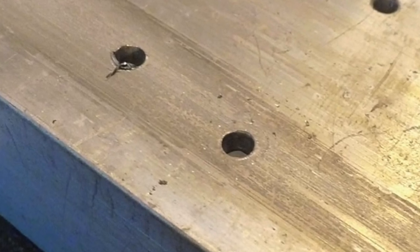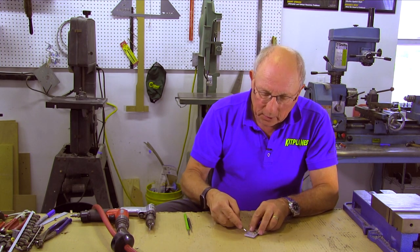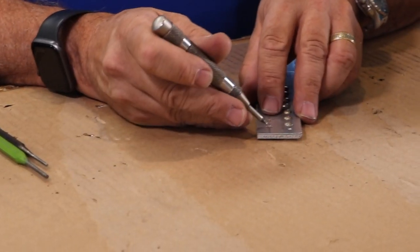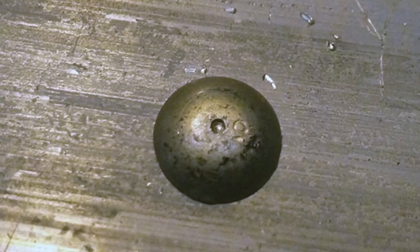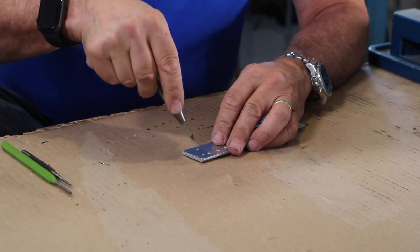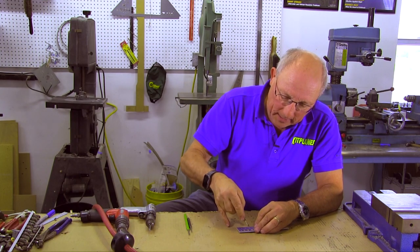That also means you have to go right dead through the center of the rivet. So in order to make sure that we get a good start, you're going to have to steer the drill a bit. To get a good start, you want to just put a little bit of a center punch. The kind of rivets we use in aviation start out with a little dimple there, so you don't have to add any more dimple. But it's a really good smart idea to take your automatic center punch and deepen up that dimple a little bit to help you get started right dead smack in the center.